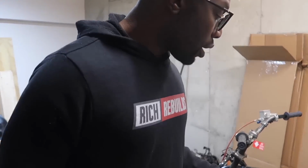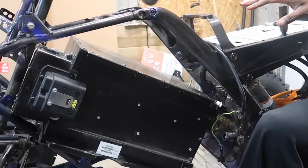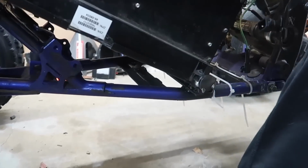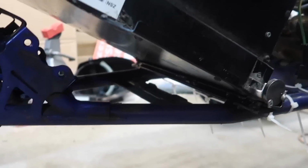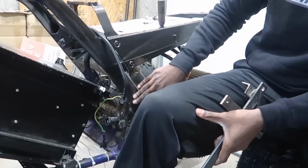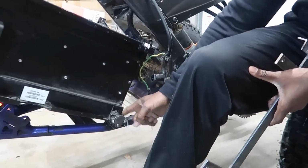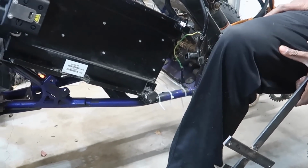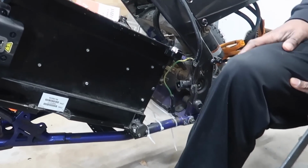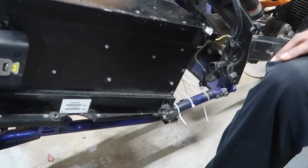Right, so now we finish up the welding of the quad itself, and this was probably the most quote-unquote exhilarating part of the entire build, because what we had to do was split the entire quad in half. After we did that, we fabricated the brackets that go to the mounting points on the frame of the quad. The front of the quad is steel, and the rear half is aluminum. So I could only weld in the front half because all I had access to was welding steel at that point. Nothing could be welded in the rear because it's aluminum and a lot more difficult to weld.